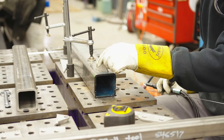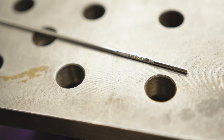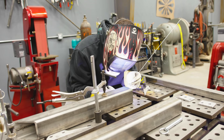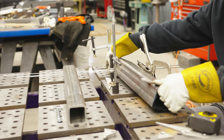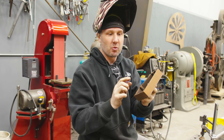These little tabs are going to hold the wheel in place. Since the whole system is stainless steel I'm using 308 TIG wire. These tabs are going to want to lift up when I weld them, so I have to clamp them down really well. I'm going to be fighting distortion this whole time on this project. Weld distortion is the force the weld applies to the material when it cools and shrinks — and stainless steel is the worst for it. The welds really like to pull, causing parts to go out of alignment. Look at it lift up already, so let me flip it over and see if I can get it to come back.